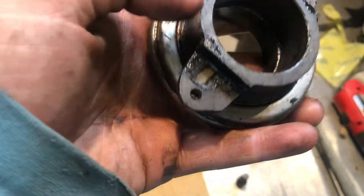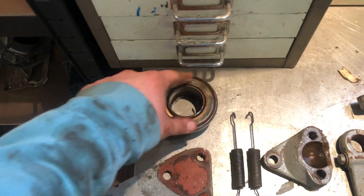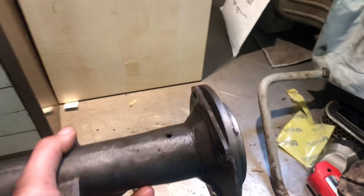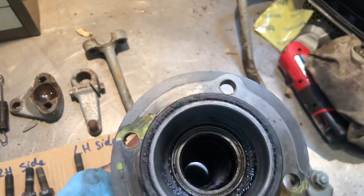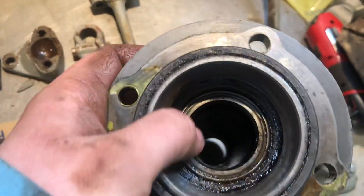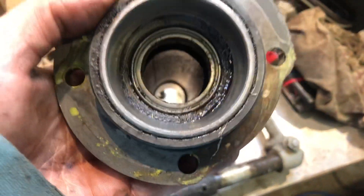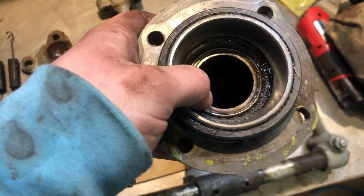You can see by the little marks exactly where the clutch fork rubs. As I said before, the bearing is in unusually good condition — no movement at all, which is a positive. As for the actual sleeve, that sits in the transmission with the input shaft down the middle, and at the end there are four bolts which bolt to the front of the transmission. You can see the bearing race for the main shaft, and this part here is the issue — the original seal, which as you can see is a leather felt-type seal.